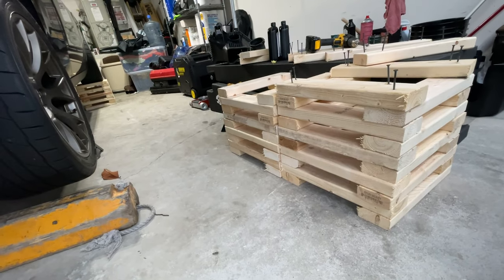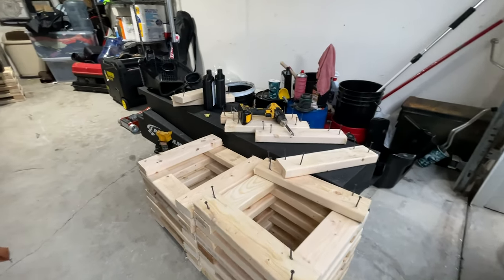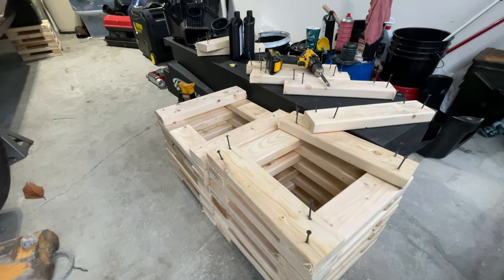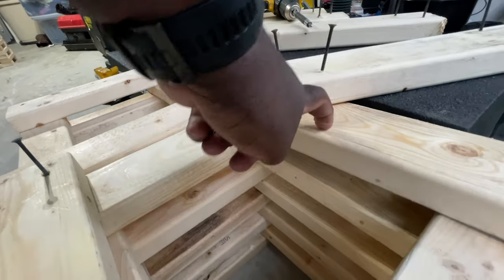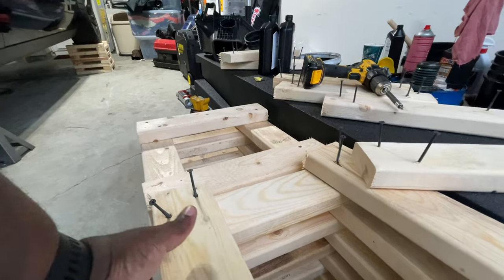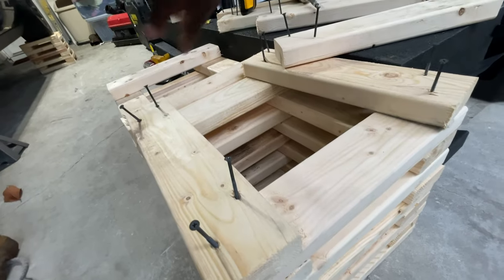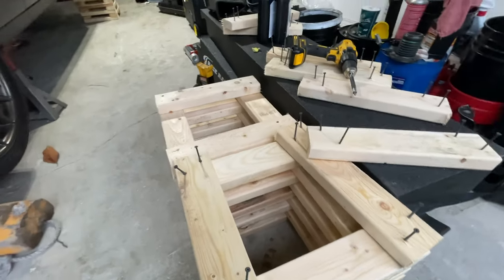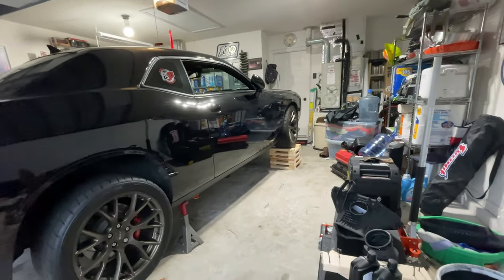All you need is a saw, some kind of cutting tool, a drill, and a whole box, about a 5-pound box, of 3-inch wood screws or drywall screws, but it has to be 3 inches, so it'll go clear through the 2x4 and have enough grip. And then it's pretty stable, so it's not going to go anywhere, because it's distributing the force around the whole thing, so it's not just on this, pushing it down. And then everything is el goodo. But there it is, just for you, Steven.